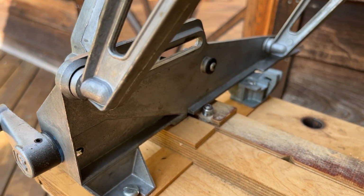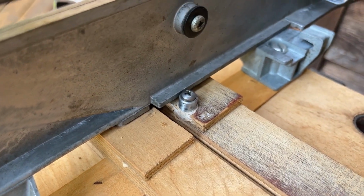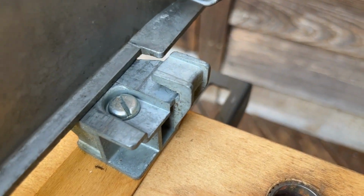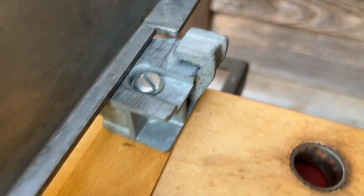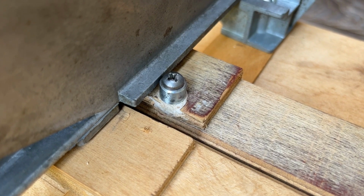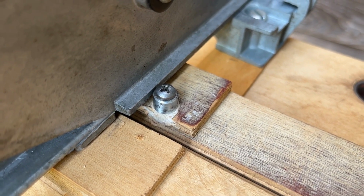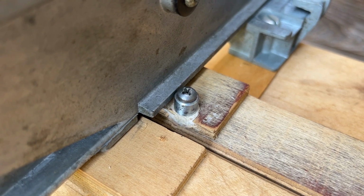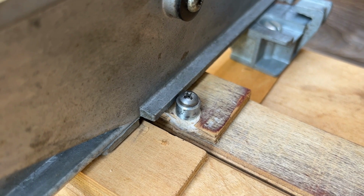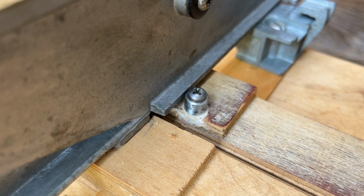On the bottom of the rear jaw on each side is a stud attached with a screw. As the jaws are unscrewed to open to their full opening, the stud hits a stepped portion of the frame back here to prevent the jaws from opening farther than they're supposed to and actually coming off. If it did not stop it there, the jaw could come off on the back. In my opinion, this is the worst design decision found on the Type E. These studs are very often bent or broken because someone tried too hard to open the jaws too far. On later types, the jaw opening is controlled in a much better, more reliable way. You can see at the base of the stud here the repair that I had to do to put this one back in working condition.